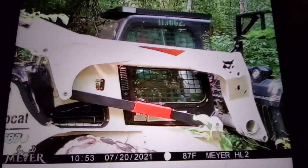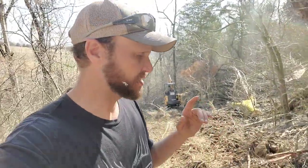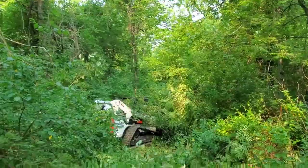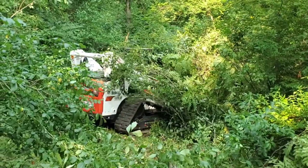Here's the trick: if you're in ridge country or hill country and your transition gets too steep, you want to work in combination with your mulcher. What I do is I put a mini excavator — this is a little Kato, like a Kato 35, a bit on the small side. I'd recommend a 10- to 12,000-pound machine with a thumb and a blade on the front. You put the mulcher in front and he mulches out the transition. On flat ground you might not need the mini, but you mulch that transition out as a real winding snake trail.